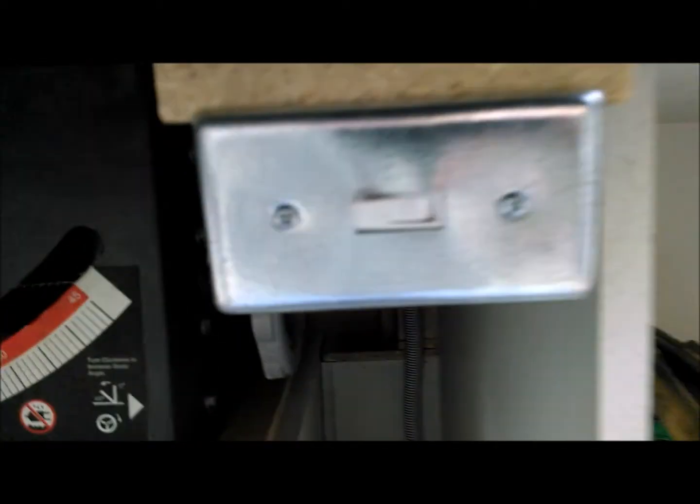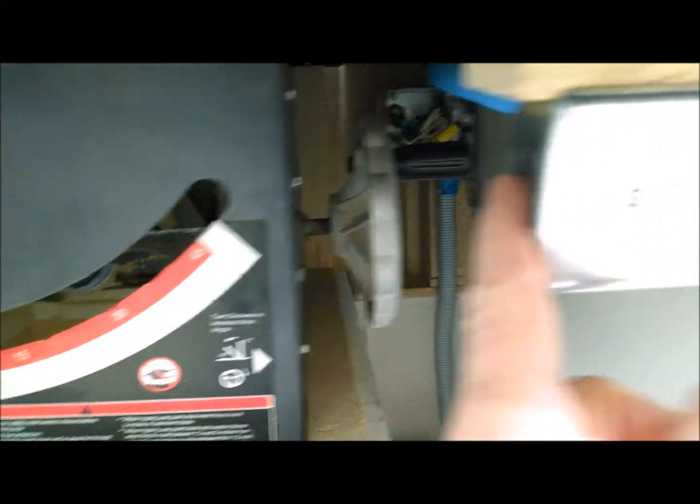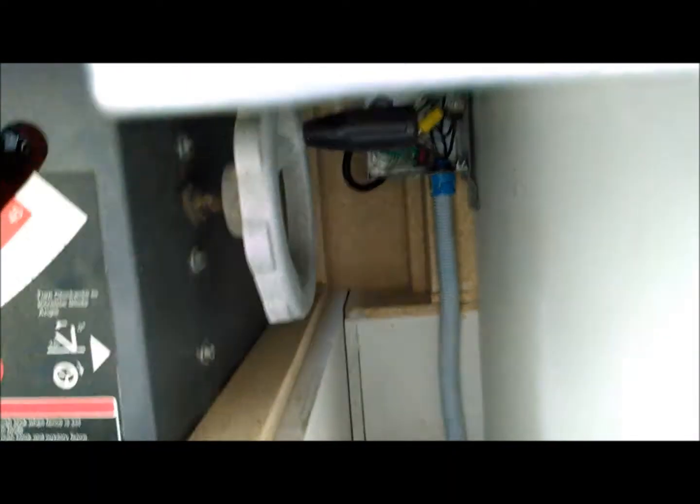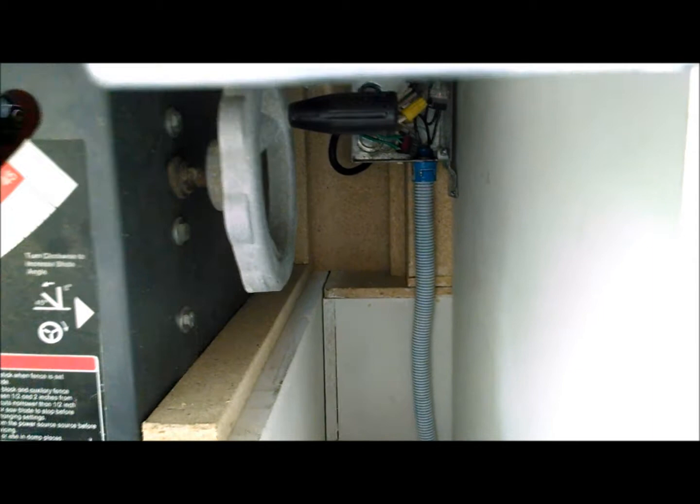Got our wiring all in place, just got to get a cover on that box back there. That is where all the main wiring will come in. From there it comes to our switch and one wire of course goes back to engage the saw. We're going to run some conduit out this side, some conduit out this side, and we'll put an outlet down on that end. I've also got to run another piece out of the back of that box that's going to run around to our router and put outlets on the other side of the table.